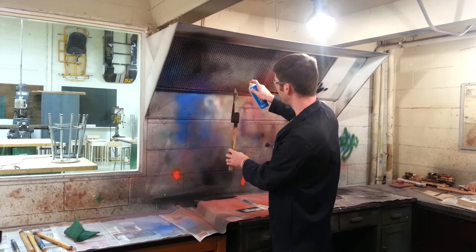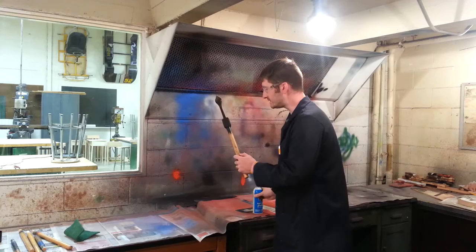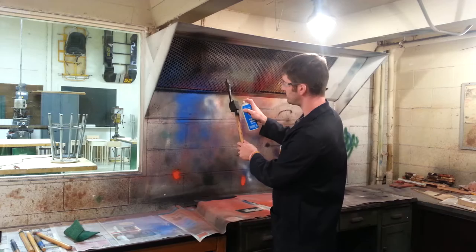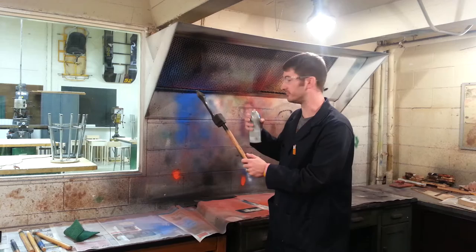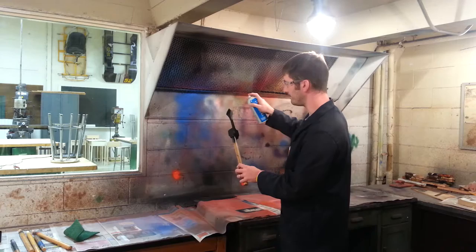I'm going to spray this on here. I'm not going to take the time to spray the entire thing. This is just a demonstration. But you can see that when I do this, you might even still see that there are some areas that are not completely filled in, and that's okay, right? Don't make the mistake of sitting here and trying to spray and spray and spray, because it will run off, all right? It'll create drips, and it'll be very, very hard to get that drip back off again. You're going to have to end up sitting there sanding the whole thing. So once again, first coats are really just meant to get that color base in and to let it sort of seep into the wood.